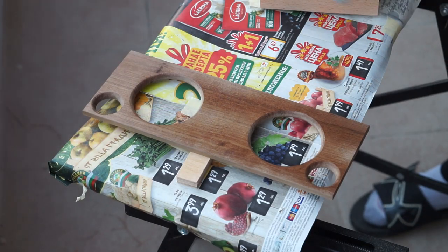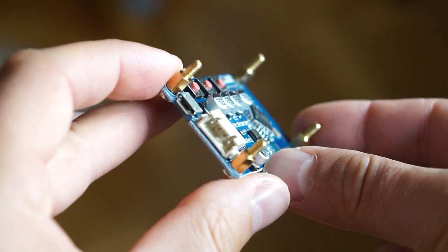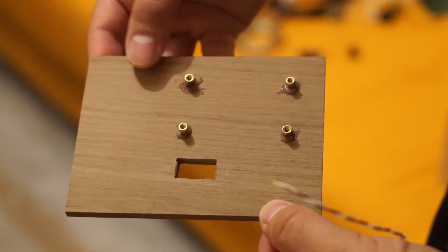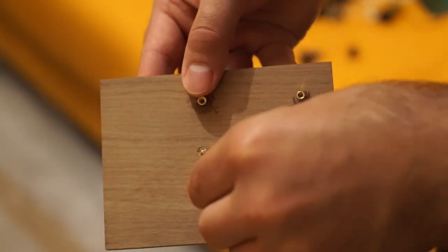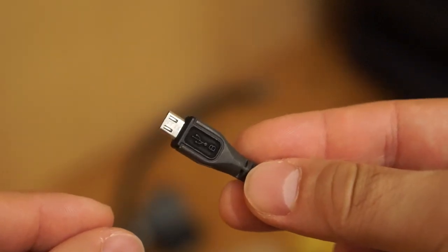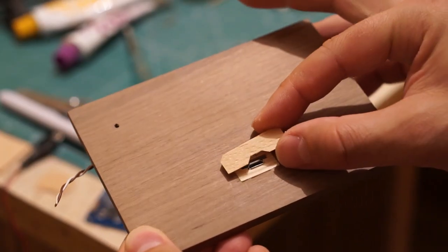Now was a good time to spray the walnut piece with lacquer as well. The amplifier board I used for this speaker comes with a Bluetooth receiver. It is powered by 5V from a cell phone charger or a computer's USB port, and it also has a 3W stereo amplifier. To send power to the amplifier, I took a microUSB breakout board and glued it between several layers of plywood. The microUSB port I'm making is going to be glued to a smaller piece of walnut, which I'll screw to the back of the speaker over the cutout. I also cut the microUSB connector from an old computer cable and stripped the wires — we only need the black and the red wire because they carry the 5V that we need. I then decided to cover the assembly with a small piece of veneer to improve its appearance.